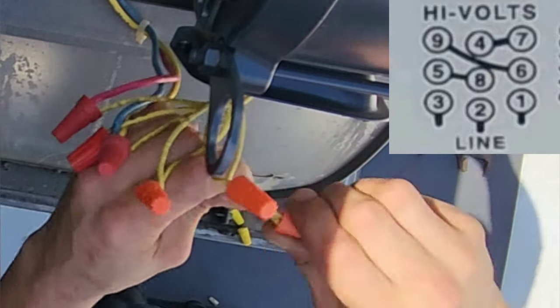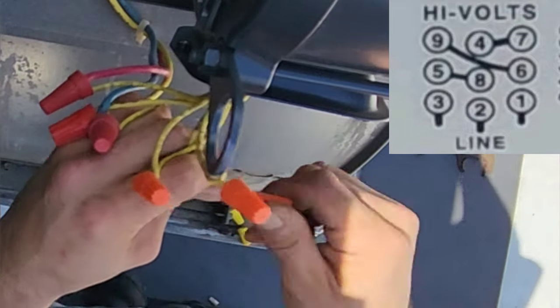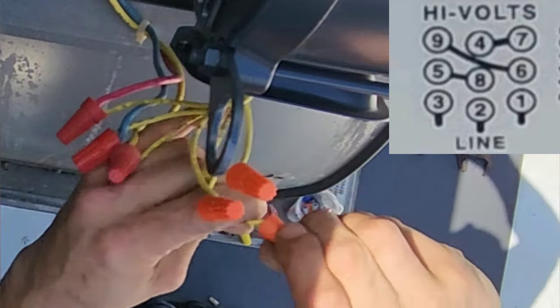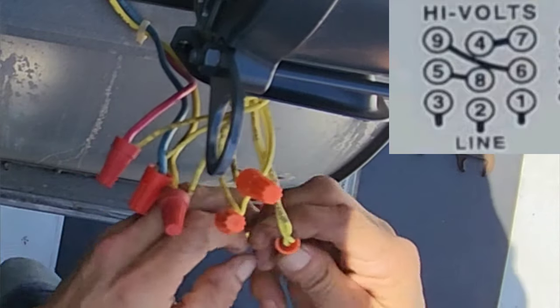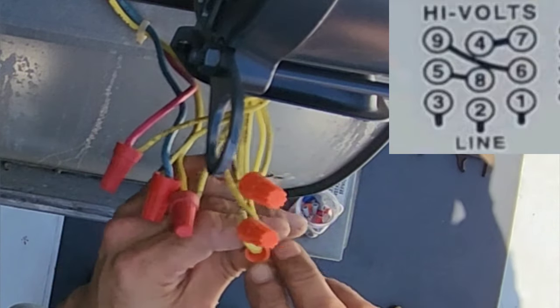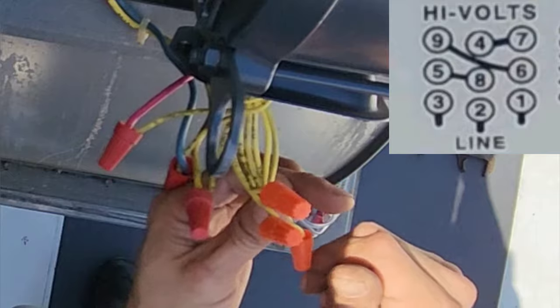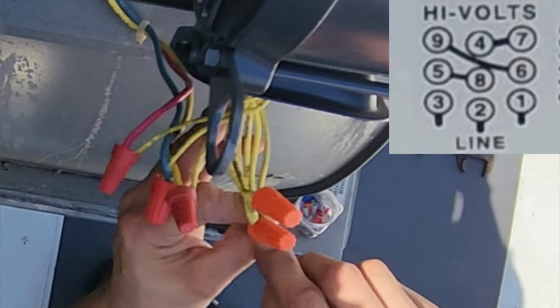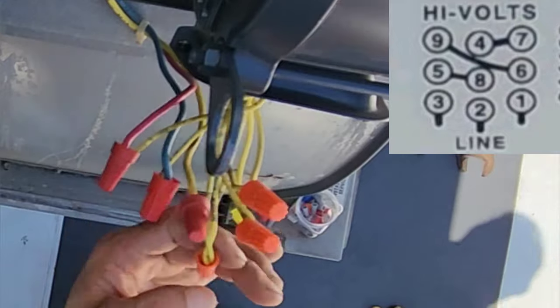If you tighten too much, it'll get easier. So like you're tightening it, right? And it's kind of tight. It's got some tension on it. And then if you're doing that and it just starts going, that means that you've broken the connection you've just made, and you need to take it apart, probably restrip it, redo it with a new wire nut, because the wire nut's gonna have that broken piece stuck inside of it that you won't be able to get out.